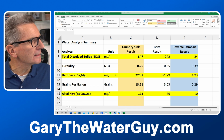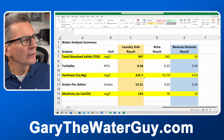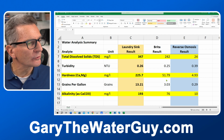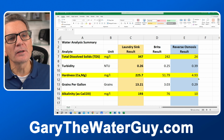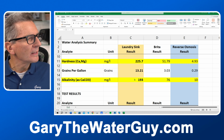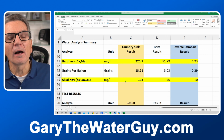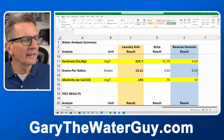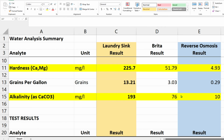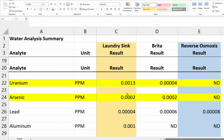You can see that the hardness, 225 parts per million. Actually, I was quite surprised that through the Brita it dropped quite a bit. And then you can see it's almost nothing after it's gone through the reverse osmosis system. And the alkalinity started off at 193 parts per million and ended up at 10 through the reverse osmosis system. And again, it improved a little bit through the Brita, so that's good news.